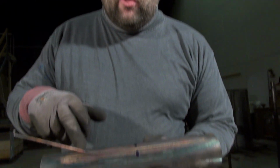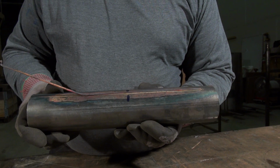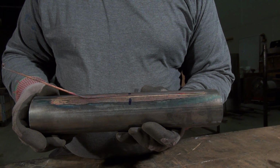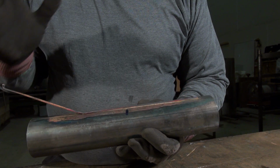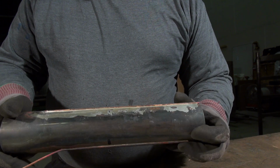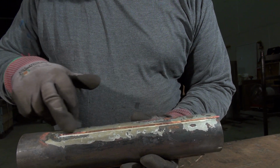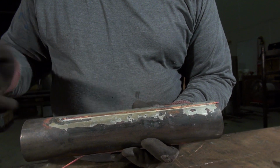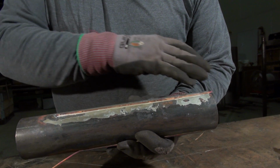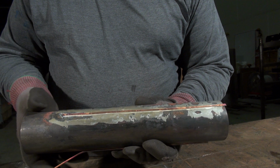What we can also see from this experiment is that the surface is somewhat corroded or oxidized by the oxygen from the air and the heat we applied to this test tube. So it would have been better if this oxidation did not occur. Now, this is the second attempt we did. In this case, the entire tube was filled up with this silver soldering material, and a lot more of this flux that prepares the surface for soldering was added in this experiment.